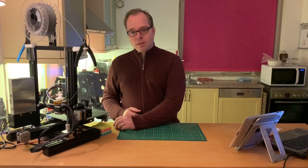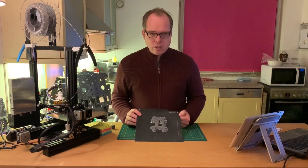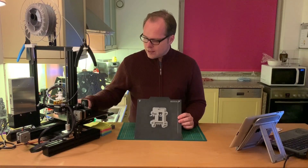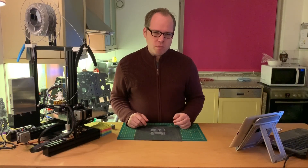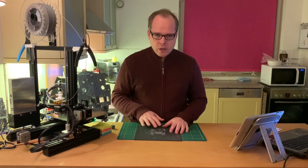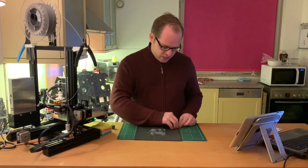As you can see, my print is ready — this is a great example to show during the review. There is a magnetic print bed on this Ender 3 Pro; it's easy to use. One extra tip from using this machine for a year: when it stops being sticky enough because you're always printing in the same spot, there's something you can do to make it sticky again.